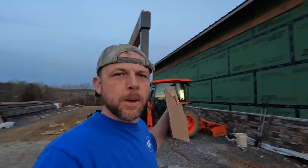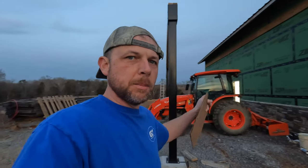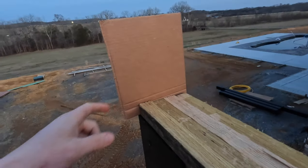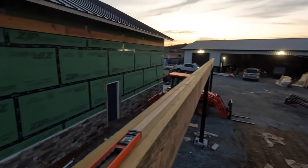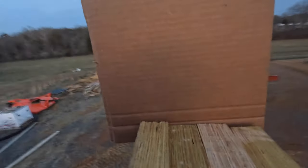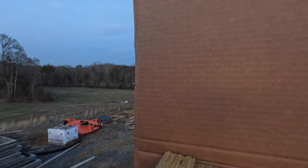I need to work on squaring this header up to the building. I've got everything squared from a dimensional standpoint at 14 feet off the building, but I want to make sure when I come back into my ledger board up there I'm square on this end. I left my ledger just a little bit long. I'm up here on top of the header at my 14-foot mark and I've plumbed both posts. I'm going to take my laser level and try to square this with it, making a sight mark down on this end so I'll have something to square it off of.